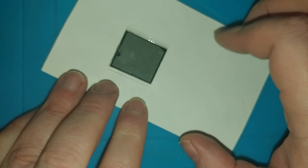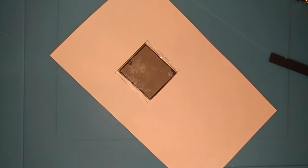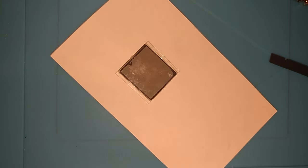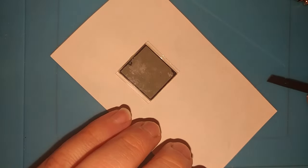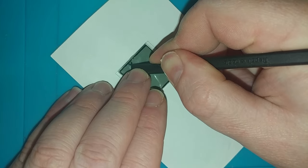It won't be noticeable. Now, you saw me switch gears a little bit from just finger pressing to actually using my hot air station. I turned the hot air station airflow to 40, temperature to 212, just to get it warmed up, because I figured, and I don't know if I broke the thing, made it worse, probably did, who knows, but that's the point of trying out something. I figured, liquid is in the name, right? Liquid crystal display. I figured if I heated up the liquid crystals a little bit, they might become a little more viscous or malleable or whatever term you want to use, and that could help me keep pressure underneath to move them along and move them across the entire glass.